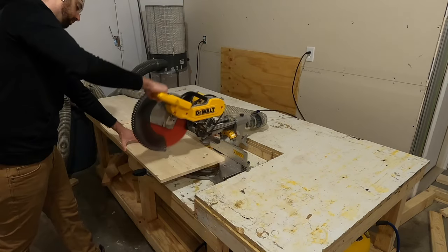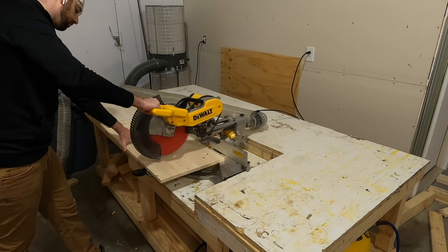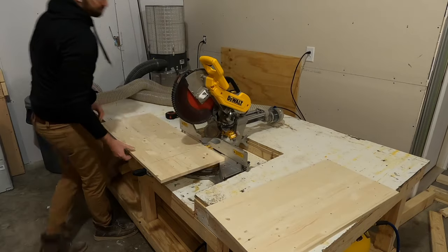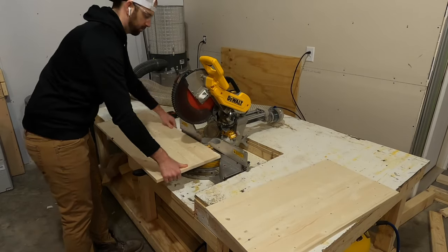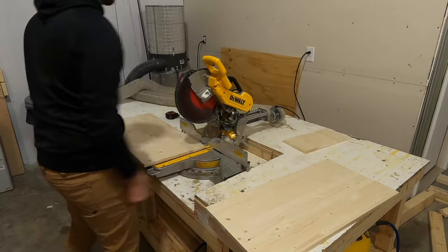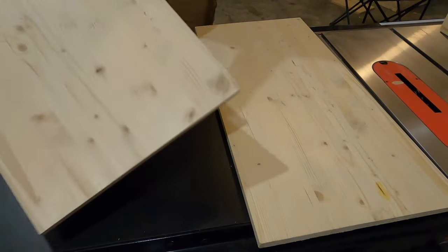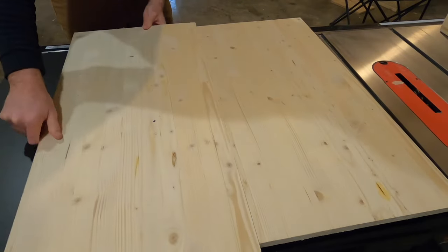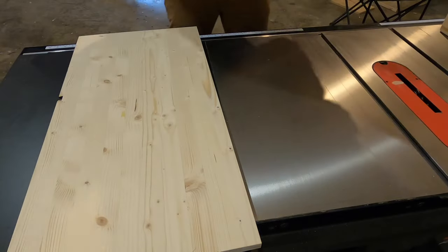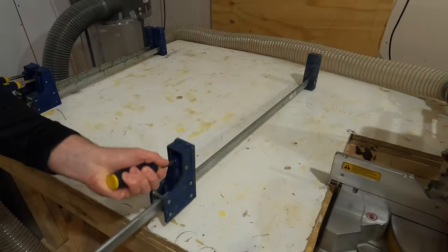Because this panel was 16 inches wide, if I double it up it'll be 32 inches wide. I first cross-cut two pieces to 32 inches long, then putting those two pieces together gives a 32 by 32 inch board. My miter saw only cross-cuts around 12 to 14 inches, so you cut on one side, flip the board over, line it up, and cut on the other side. Then put the boards together — there will usually be one better edge, so flip them until you find the best seam.